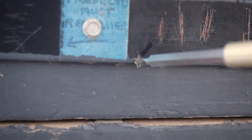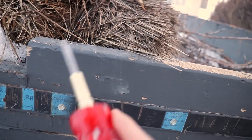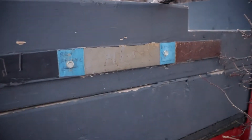It's snowy here in Canada. This is the side with the Cosmoline. You can see I'm peeling it off there. Pretty cool stuff. And you can see no rust underneath. Again, I could easily be scraping it off, this isn't the greatest test. It's hard to do these. And then over here, this is just Cosmoline. I should have done that over here so you could see the rust underneath before I painted it, but I didn't. So this is the really cool test. You can see the previous scrapes, and you can see some minor rust right there. But everywhere else is clean after I scraped it with the screwdriver. So I'll do it again just to show you. You can see no rust.